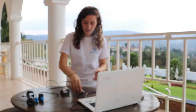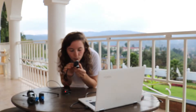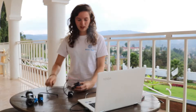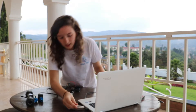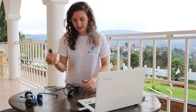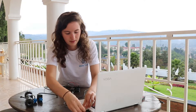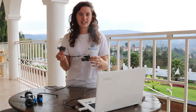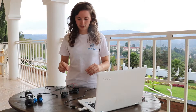To test if it works, you can blow through the flow meter in the direction that the arrow is facing, and that will show you on your screen that this setup works. If you want to check that your data logging is working, you need one of these SD card readers if your computer doesn't have one built in. You simply plug that in, take out the SD card and plug that in, and when you open up the files you'll be able to see your comma separated variable file of all the readings that you took — this is really easy to import into Excel.